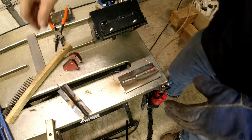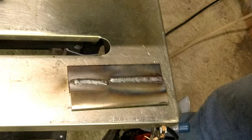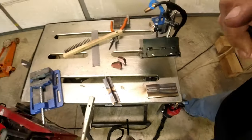Part of the way through I had to stop and increase my wire feed just a little bit because it was melting back — I couldn't get the wire in fast enough. So we just did a little spiral as it went through.